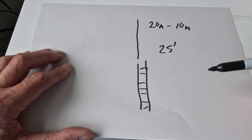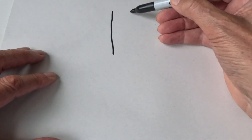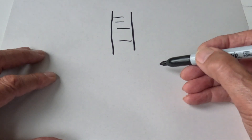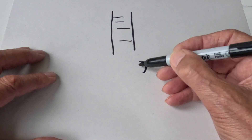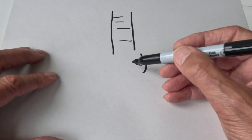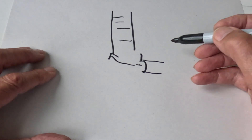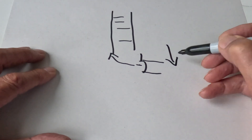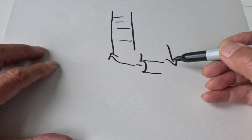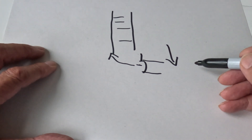Let's see how we feed the antenna, looking closely at the feed point at the bottom of the balance line. We have the balance line there, the rest of the antenna up above. We have a coax feed: the shield goes to the right-hand side of the balance line, and the inner conductor goes to the other side. We then immediately have a line isolator - that could also be a 1:1 or 4:1 balun, but the line isolator works just as well.